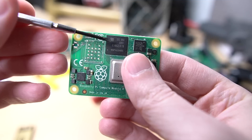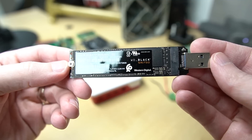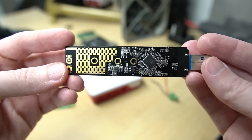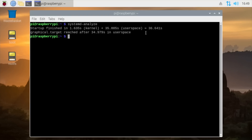I wanted to compare boot times and app launch times, and compare against a number of different boot options: the built-in eMMC storage, a fast microSD card — in my case a 64GB SanDisk Extreme — and the exact same SSD in a USB 3.0 to NVMe adapter like you'd use on a Raspberry Pi 4. I should mention I made sure to disable Bluetooth by adding the disable-bt overlay to my boot config, then disabled HCI UART. I found the measured boot time was a lot longer on Pis without built-in Bluetooth if I didn't do that. With that sorted, here are the numbers.